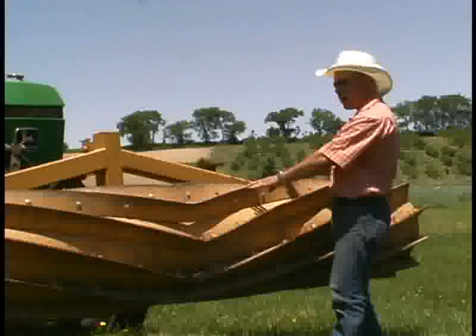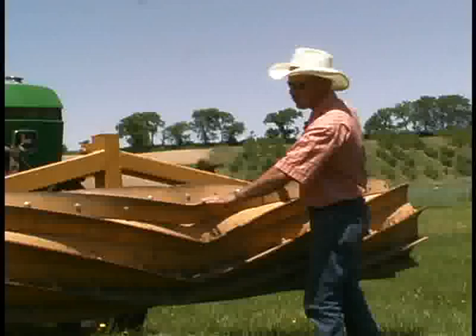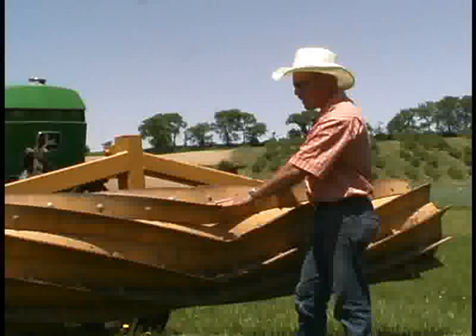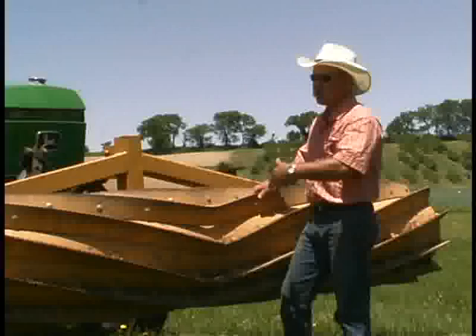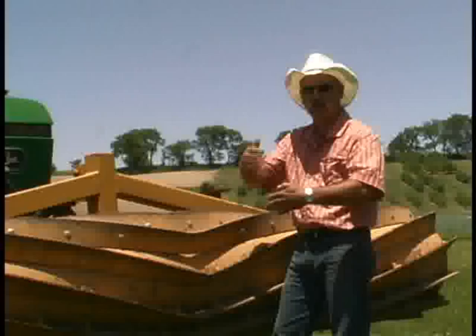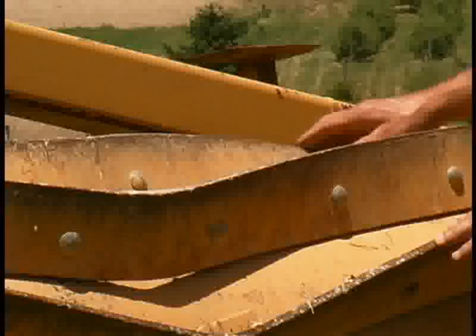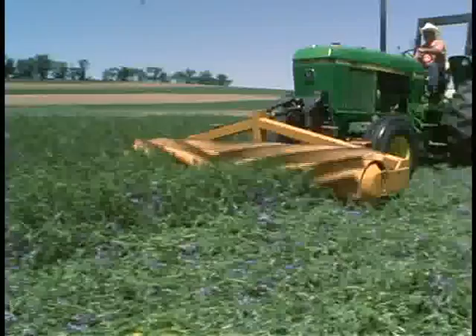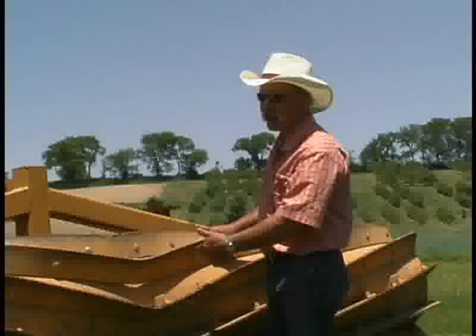You'll notice that these blades are not mounted horizontally in a straight line across the cylinder. They're actually mounted in a chevron pattern where they curve up towards the ends and sort of follow a twist along the curvature of the cylinder. The reason we did that was if these blades were mounted perfectly horizontally, they would touch the ground, then be in the air, and you'd get a bouncing effect. By putting the blades in this chevron pattern, it minimizes that to the point where the blade is continuously touching the ground at any one point in time. The weight of the roller is distributed across a very small portion of the blade as it continuously rolls across the ground, which magnifies the weight of the blade as it tries to crimp the cover crop. That's really added to the success of this particular tool.